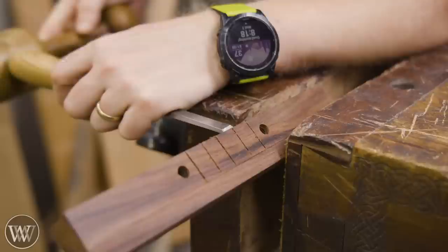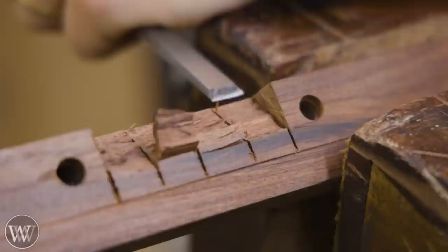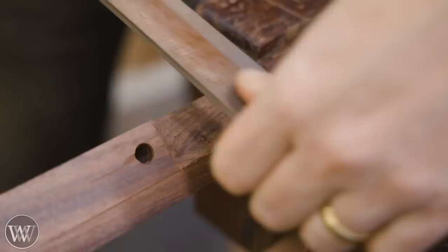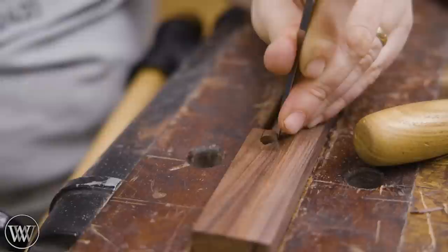For the escapement, where the chips will actually come out, we need to chop back. I made several stop cuts along it, and then we can come in with the chisel and remove most of the material between them. I highly enjoyed this step — there's just something about removing large chunks with a chisel that is very enjoyable. We'll get it close to the size we want, then come in with the rabbited block plane to get right down to the line, and then smooth it all out with the file and rasp to create a nice escapement.